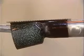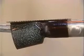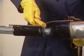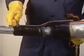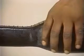Extinguish your torch and let the sleeve cool. Once the sleeve has cooled enough for the adhesive to bond to the lead auxiliary, resume heating the sleeve until it is fully recovered. Be sure to use a blunt object to help the channel conform to the diameter change in the transition area. As with all WRSS installations, the metal channel must be cool to the touch before the cable can be moved, bent, or repressurized.